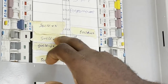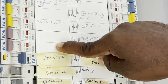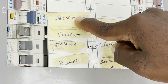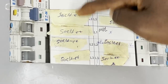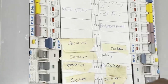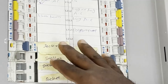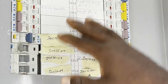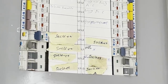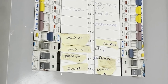I would recommend that you do have RCBOs installed. I think people don't install them due to the cost — this ordinary MCB is about 150 cedis, but the RCBO ranges from 250 to 300 Ghana cedis each. We need eight of them, so that's about 2,400 cedis just on the RCBOs. That's what puts some people off, but safety first — worry about finances later. If you can afford to build, you can afford to be safe in the electrical installation.